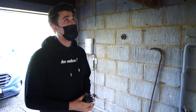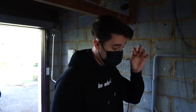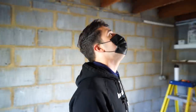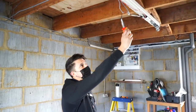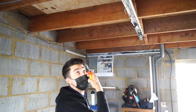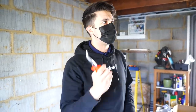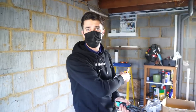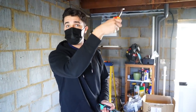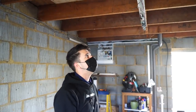The other thing is the lighting in here. I don't think it's ever really worked properly, and I'm just having a look at it and it's not hard to see why. What I don't get is they've got a neutral there, which I'm pretty sure runs back to the board because I tested it, but then you've also got a singles neutral. So straight away, that says to me someone's done that who doesn't really know what they're doing, because why would you have a perfectly good neutral which goes all the way back to the board, fold it up and coil it up back in the board, and then run a single core neutral there as well? Doesn't seem to make sense. Maybe it will later and I'll eat my words, we'll see.